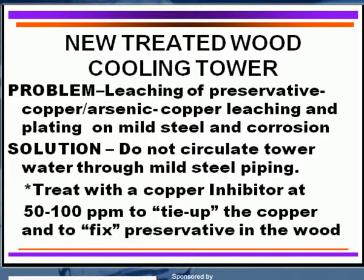This treated wood is usually Douglas fir. We don't use redwood that often, though it is available. Redwood has a preservative entirely through the entire 4x4, or that particular wooden section in the cooling tower, while Douglas fir does not have any protection whatsoever.